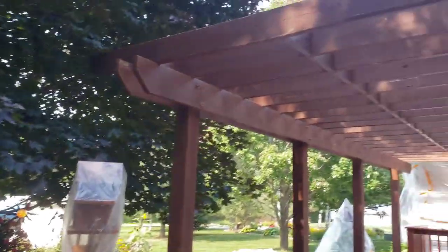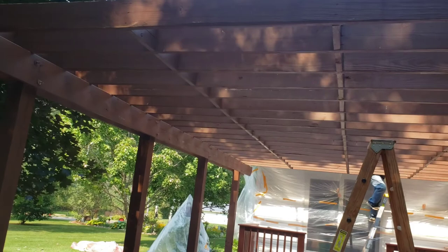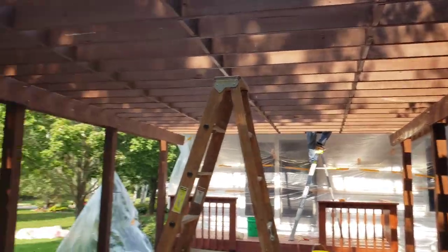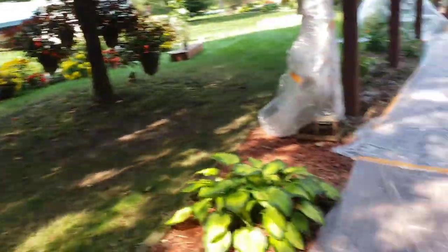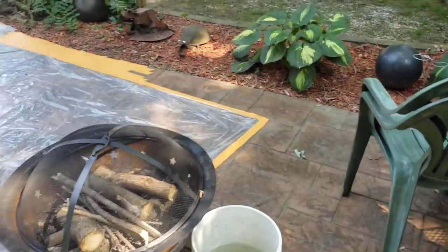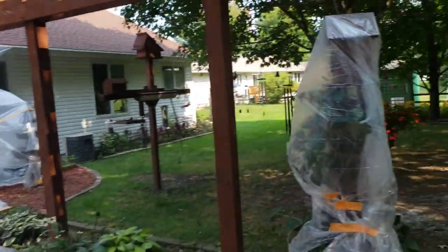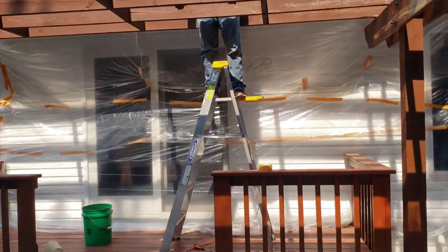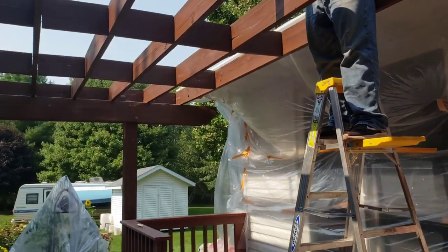So here's what we're going to be spraying. It had a latex-based stain on it before, but since there's no heavy foot traffic and it's above grade, it lasted quite a while. We did a chemical clean on it and now we're getting ready to spray it with a solid acrylic. We taped up the entire area — all the stamped concrete — since we definitely do not want any overspray on it.